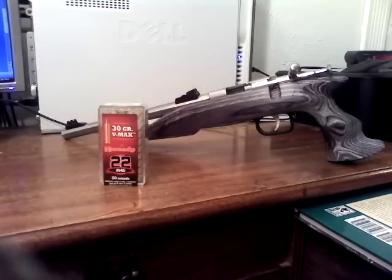I then took the pistol to my local gun range and at 25 yards off a sandbag rest with the same 30-grain V-MAX Hornady ammo, I made four five-shot groups onto paper plates while sighting it in, also breaking in the barrel and becoming familiar with the trigger. Each group was between 0.75 inches and 2.5 inches. I did not bring the chronograph, but the ammo is listed on the box at 2200 feet per second muzzle velocity, and I would expect it to be around 1950 fps with the 10.5-inch barrel.